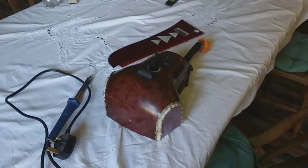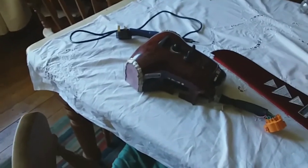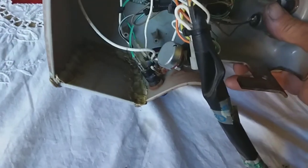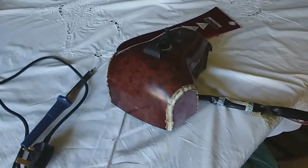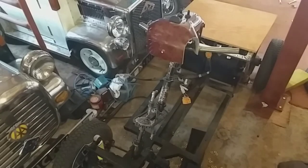I've chopped up the front tiller plastic cover to get some bits to put on the sides of the steering piece, and also cut some strips off to strengthen it on the inside. I cut these off on a bandsaw. To strengthen the inside, if you cut some strips, you can solder it round — it looks a bit messy in there, but it won't show once it's sanded up. Once this is sanded up and cleaned off the edges, I'm going to spray these ends a dark brown with some paint I've got. I melted these on with just an ordinary cheap soldering iron.